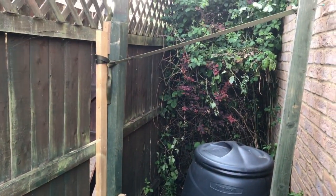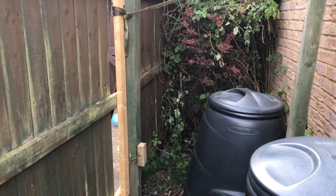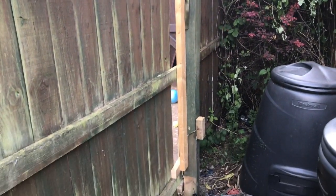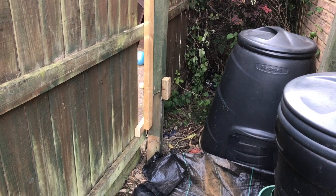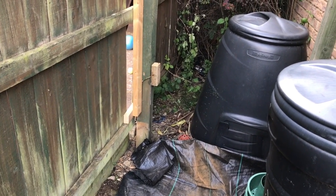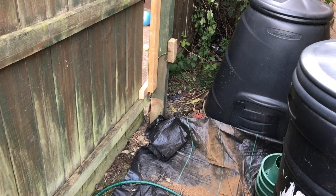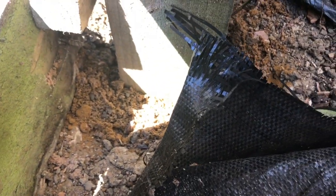I've got some rope in it at the moment — that's just while the glue dries, just to stop it blowing. There's a slight bit of movement in it actually. As you can see it's just a little tremor when I push on it, and that's mainly me. So there you go. If you haven't got the money to pay for a complete fence post replacement but you have some wood lying around, you can do a cross cut on one piece and a cross cut on the other piece, dig out the soil, and insert the post as I've done here. I noticed this morning there's some movement on the fence, just because this piece of wood is not quite the same size as the last one.